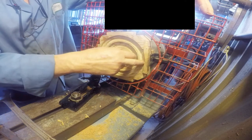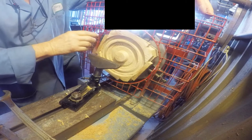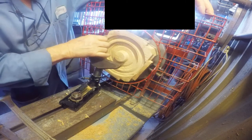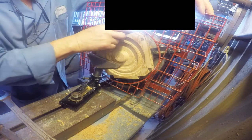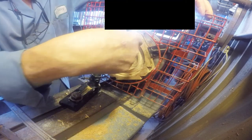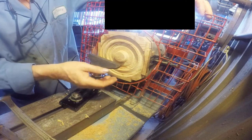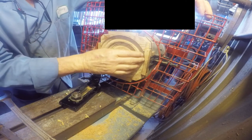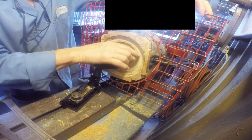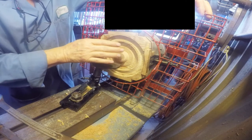Before I machined this up, I noticed it was really bad and I thought I might be able to get away with it. What I did was cut that little section here — this one's machined away, so I machined both sides and dropped these hungry boards down lower, glued them in and nailed them in — angled the nails. The reason it tears out like that is first of all it's Oregon. Most woods would tend to tear or crack in this section because you're going with the grain but machining across the grain. Oregon's not very good across the grain, but with the grain it's very good for structure — that's why they use it.